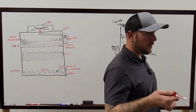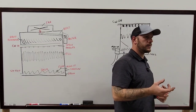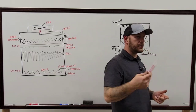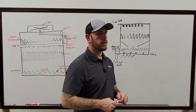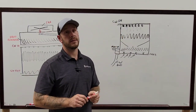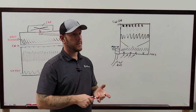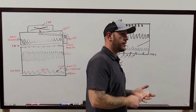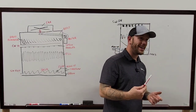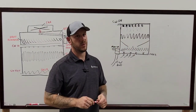It's the locking one that goes onto the shaft itself. It's got the locking collar on it, on the pillow block bearing. Oh! It goes with the rotation of the shaft. So the inner race. Is that what it's called, the inner race? Yeah, it's built into the bearing. It has the Allen. Yes, okay, it's built into the race. Yes. That always goes on the bottom. And you lock it with the rotation of the shaft. If you go against it, when it spins the opposite way, it loosens the Allen wrench out and pushes it out. I've done it twice.